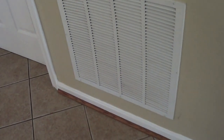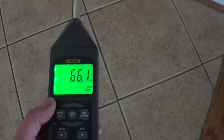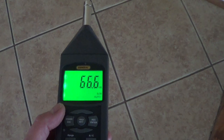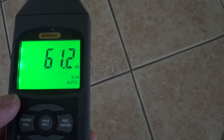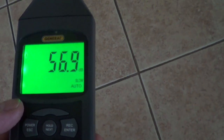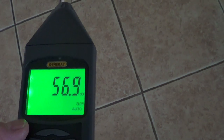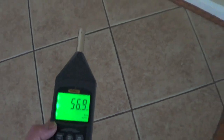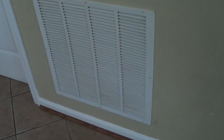That will match the two-and-a-half tons for the airflow. I want to show the sound difference — right now with me talking it's about 70 dB. Now let's watch the actual sound. I'm two feet back from the vent. It's about 57 DBA when set on slow.